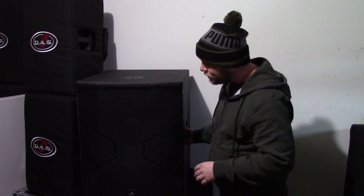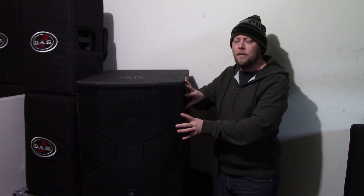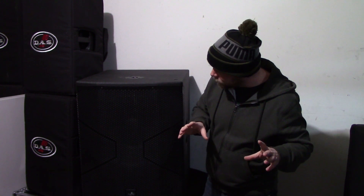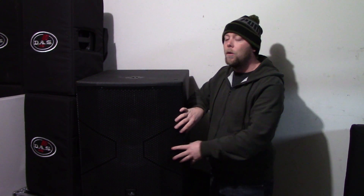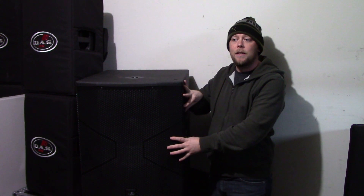There's one more thing to mention. In my Turbosound IQ15B review, my main issue was there was no proper high pass filter for the outputs. That is one thing I do like about this — it has a built-in crossover not only for the speaker cabinet but one that affects the outputs. So it doesn't matter what tops you use, whether or not they have a built-in crossover. Somebody can rent this, run left and right into the sub, left and right out of the sub into their tops, engage the high pass filter, and their tops are crossed over properly.